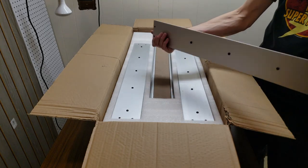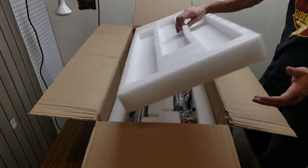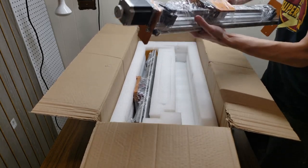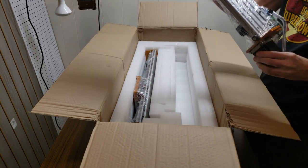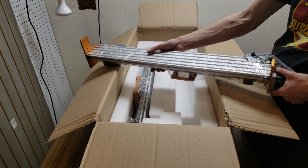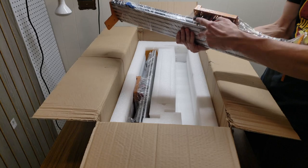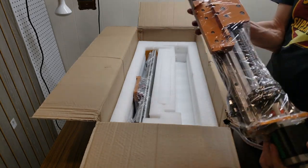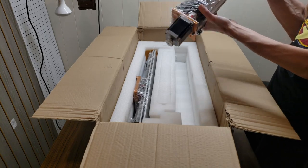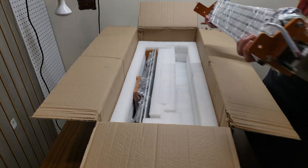The bed is nice — it comes in individual segments. The two Y rails are massive. I counted ten holes. I thought these were going to be 2080s but they are 2100s. At the top you've got 15mm linear bearing rails bolted on with two bearing blocks, and a very nicely machined solid aluminum carriage plate. There's the ball screw thrust bearing, coupling, the other bearing block on the end, end limit switches, and very nice orange aluminum plates all around.